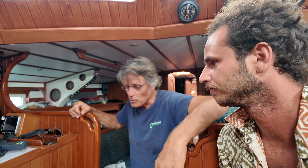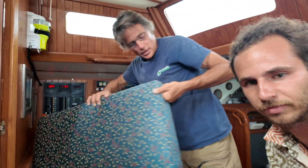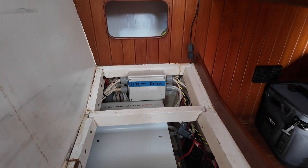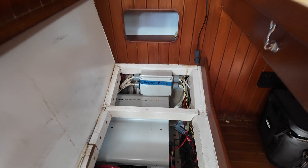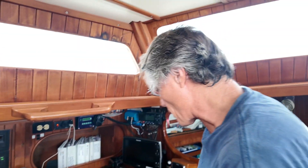This is a nice little 250 watt, which may be much more efficient. We can take a quick peek at the 3000 watt inverter - that's the big guy - it has a fair amount of idle power draw, even if it's not outputting much power, so we don't want to turn that on for small loads. Mostly we use that for charging when we kick the generator on, which is also a charger for the batteries.